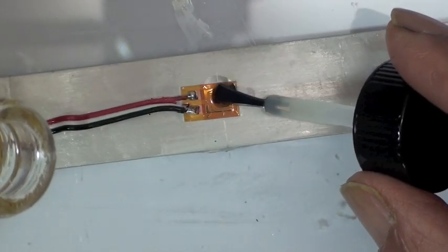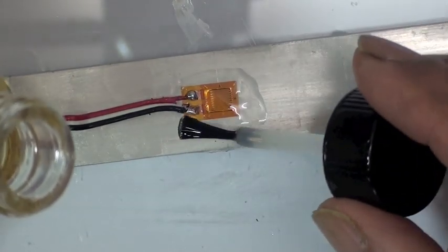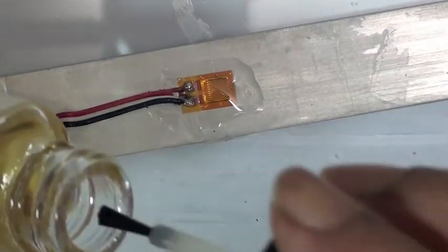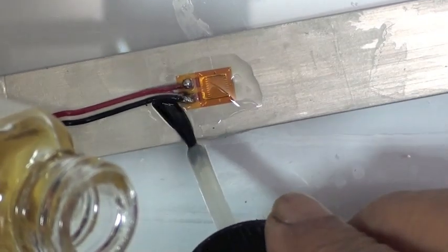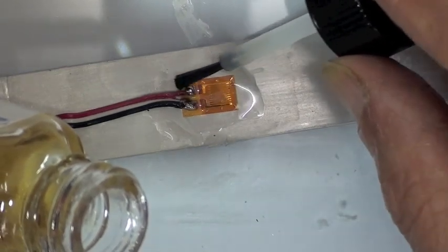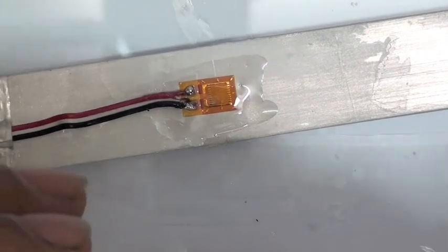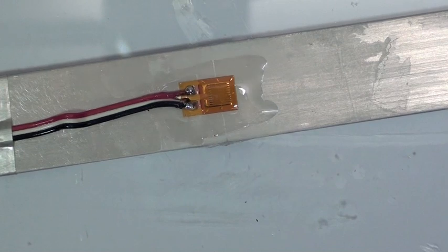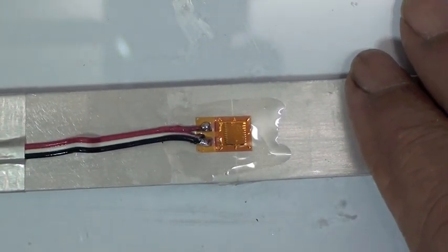So this is a brush-on coating. It's just brushed on in a thin layer, and it's a very good humidity barrier. It will seal things to the surface like that wire. You want to make sure it's around the wire, over the wire, and even under the wire at the loop. And once this dries, it really ruggedizes the installation. With that lead wire anchored and this coating in place, you've got a barrier against humidity damage to the adhesive, and something that's going to ruggedize it against being scraped off easily.